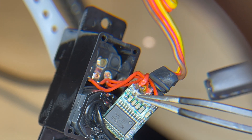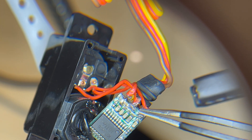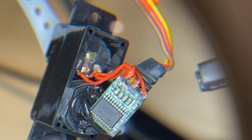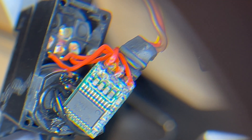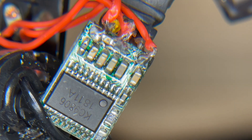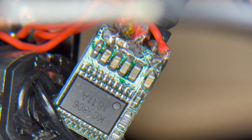The Chuck flight controller unit is now living in a new frame, being the Opterra. But the flight controller has no idea it is doing that. So since the servos are flipped, every right input of the flight controller unit in reality would be a left one and vice versa. So when it's trying to stabilize the aircraft, it is giving exactly the wrong opposite inputs, basically ramming the aircraft right into the ground.